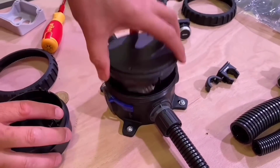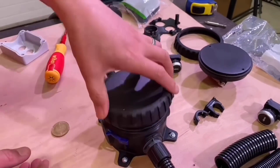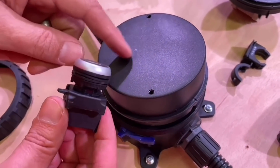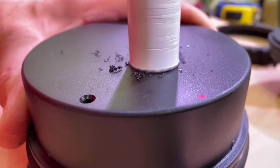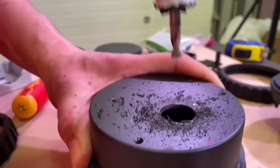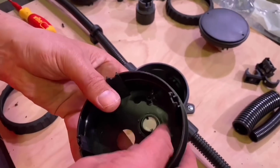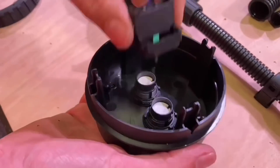There's also a standard lid and an increased depth lid. The increased depth lid gives more wiring room — you could have the DIN rail terminal in the back, or use it to mount 22mm push buttons, which are standard industrial push buttons. There's plenty of room for two push buttons, plus indicators or other things you want to add. It saves adding extra bits to your system. We're going to use this around the workshop — stay tuned on the channel. Regular viewers might already know what it's for.